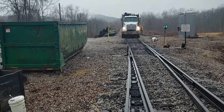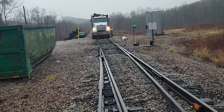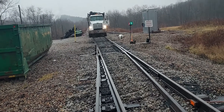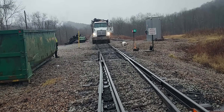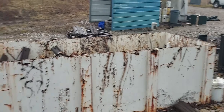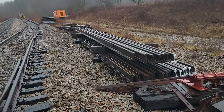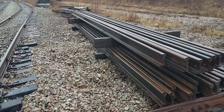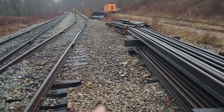He's going to get flipped around there with the grapple truck. There's one piece of rail off to the right. We found we have two Sperry rails. A Sperry rail is a rail that has a defect in it, found by an ultrasonic rail tester. We've had Sperry, Ensco, Nordco, and Herzog in here before, and it doesn't matter who finds it — we still call it a Sperry rail.